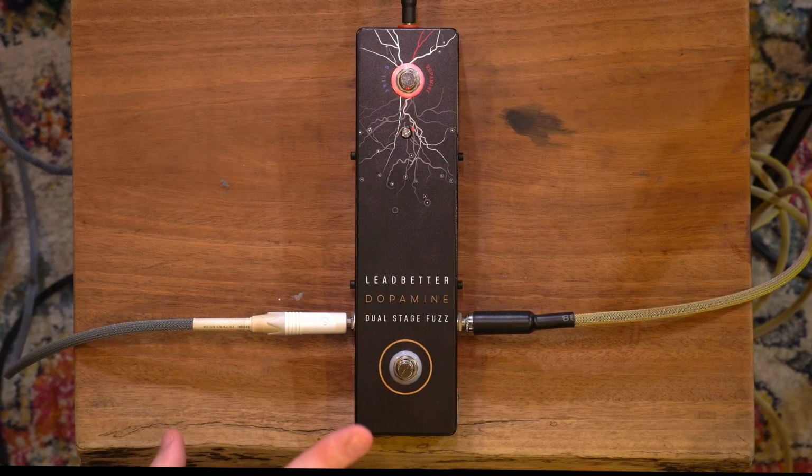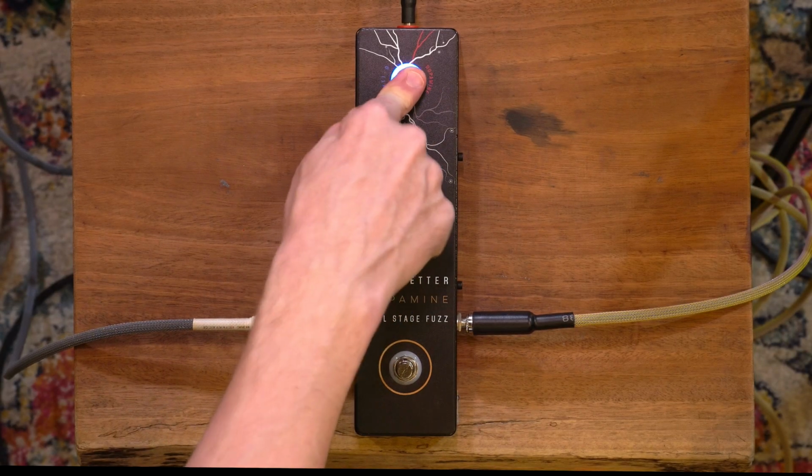Basically what it does is, and I'll read from the thing because then I know. The red side is the way it's intended to be. When you go to the blue side, you engage an internal adjustable Trimpot, which we'll get to, with an additional treble bleed NOS capacitor that reduces the guitar signal hitting the fuzz circuit, which results in a glassy fuzz drive tone. If the internal Trimpot is turned up full, it'll sound exactly the same as red mode. So it's almost like turning the volume down a bit, with a treble bleed.